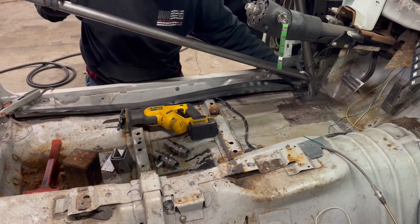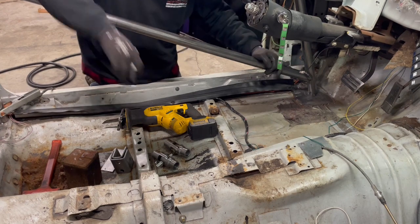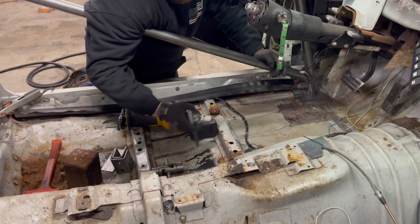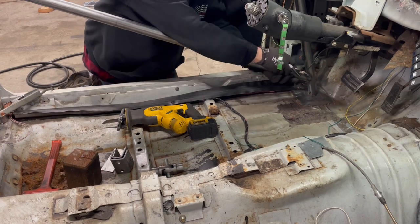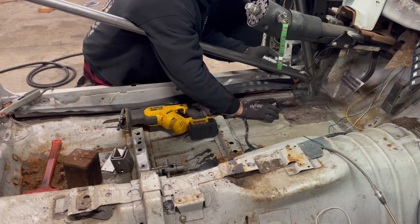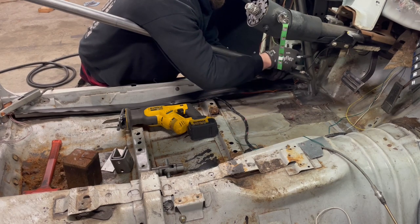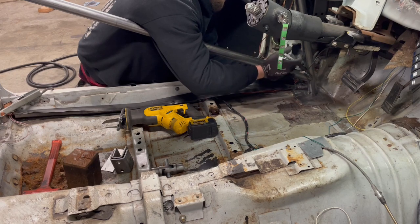and then I can fully weld the rest of that out of the car without worry. So good thing with putting in these clevises is that we've got some leeway in terms of how much material we need to remove from the door bar itself. I mean, we're going to be taking a chunk out, probably a 2-inch chunk on both the top and the bottom. So kind of just set this on here to determine about where I want this thing, because when it swings, we need to make sure it's not going to run into the car.